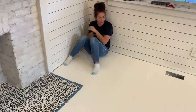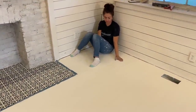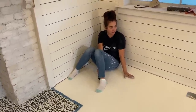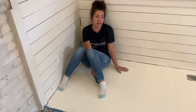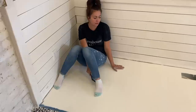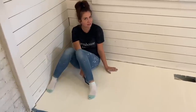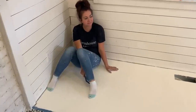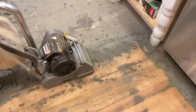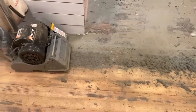I think I have spent more time on my hands and knees on this floor than I've ever spent on any floor. I thought painting was going to be easier but it's a little complicated on old nasty floors. I think if we would have stained these it would have been even worse because they were just so gross. I'm looking forward to painting fresh wood floors and not a hundred-year-old ones. If your floor isn't in as bad condition as this one, it would be pretty easy to just scuff it up a little so the paint sticks and then paint it.